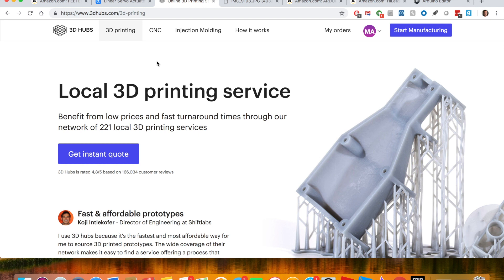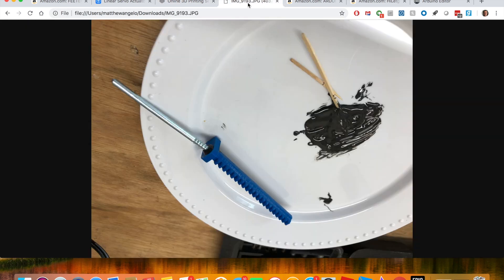Also, I've found that two of the libraries in the neighboring towns have 3D printers. I joined one of those for free and was able to print what you saw in the video for only $0.10 a gram, which came to $1.20. So check out your local libraries. After I got it printed, this is the pusher rod — I drilled a small hole in the end and used some epoxy to embed this metal rod, and that's what pushes through the drawer slider, as you saw earlier.